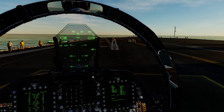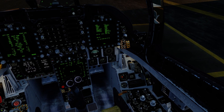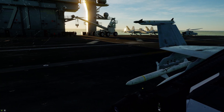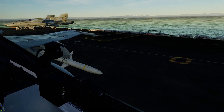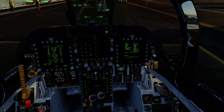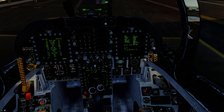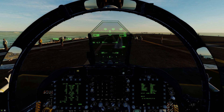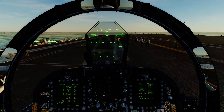He's giving me the wing spread signal, so I'll pause. On wing spread, the manual says to lower to spread position and wait until they're fully unfolded before locking. My theory is the locking mechanism could break pinion gears if you lock too early. Wings are down and locked. I'm going to unsafe my seat — seat is now armed. He's guiding me in; I'll go slightly left to line up.